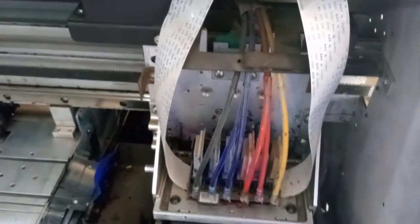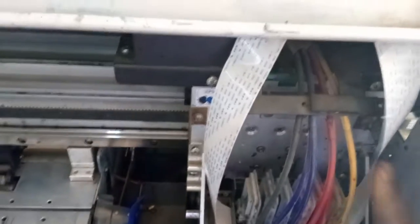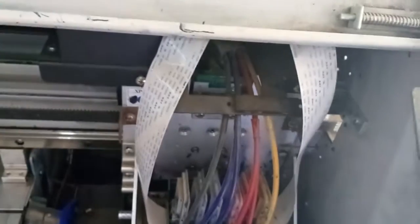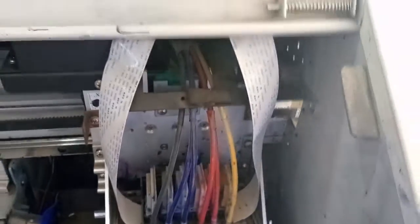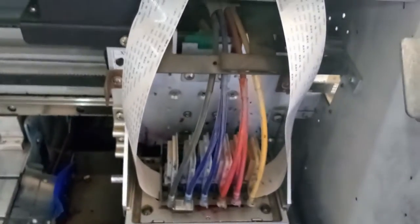That's pretty much it. Error link fail means this board is not communicating with that board. Check the cables. If the cables are fine, check the printer head — is it connected on the right side? If not, test the boards. I really hope it's not the boards because boards are quite expensive on large format machines. As someone once said, if you have a large format, be ready for large problems.